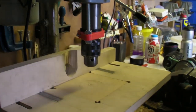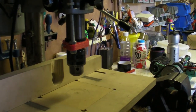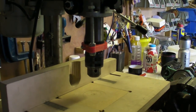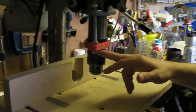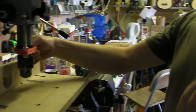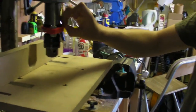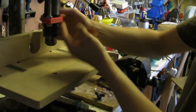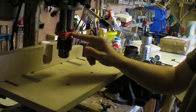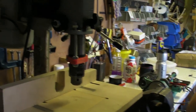It gets in the way, it means you can't see what you're doing. Okay, if this was a really full-size heavy duty milling machine you'd understand why you need the guard, but we're working with small pieces of wood and sometimes very small pieces of aluminium. What's going to stop you wearing goggles if it's something dangerous anyway? We've got a face shield, we've got goggles, and all of those are better than the shield that was on here. The original guard isn't here now because it was so flimsy - it was a very thin layer of plastic, about a millimetre thick, with lips to fit around the elements. Whereas this is solid plastic all the way through. It's still ABS - they used ABS too - but just much more heavy duty.